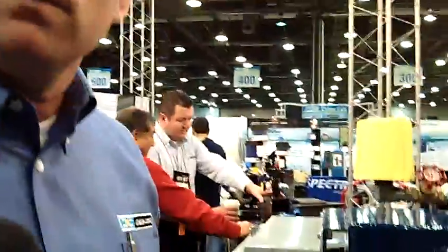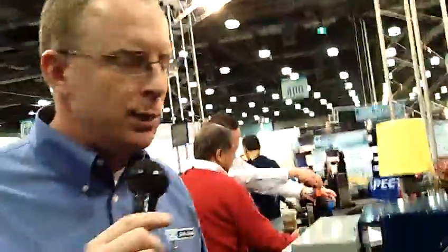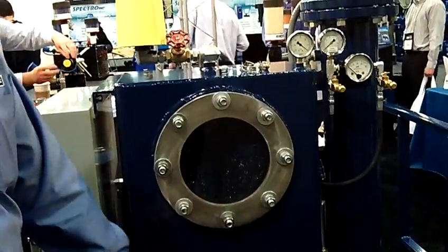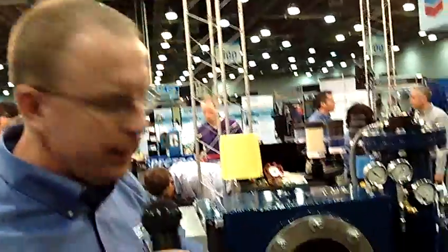This is an actual functioning unit. These portals are always on the unit so that the customer can see what's going on inside. It's really important for the operators to be able to view what's happening here — not only to see what the oil level is down here in the bottom, but also to see the action of the water being removed from the oil. When the water is extracted from the oil, it causes the oil to foam. It's important that the operator is able to see that action in this upper view window. These windows always come with this kind of chamber.